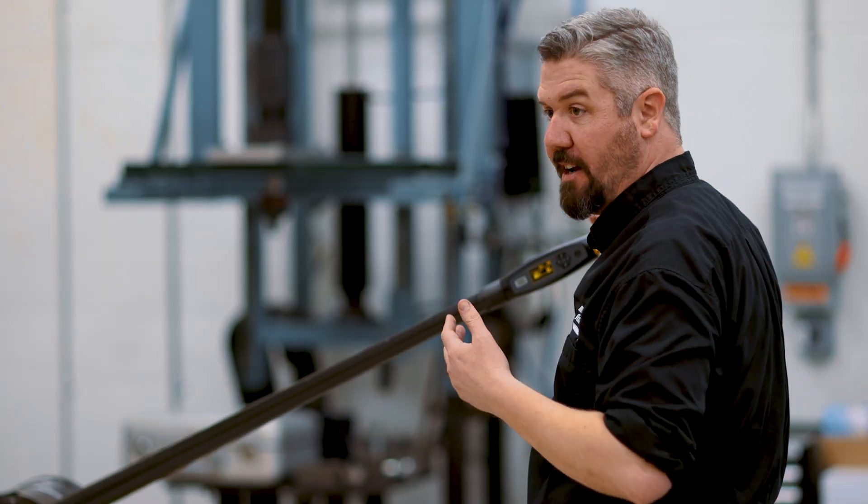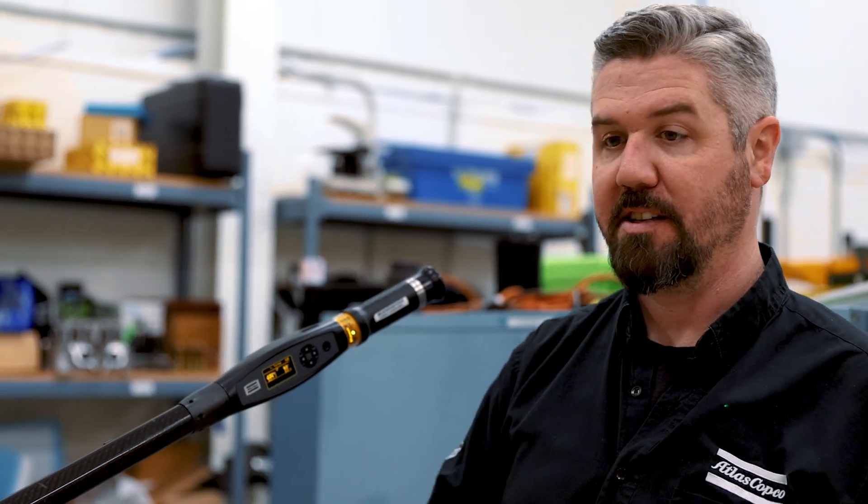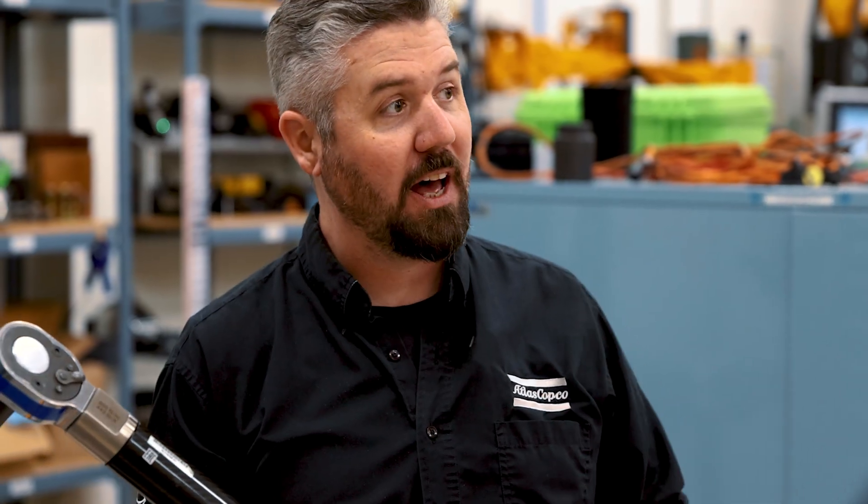There we go — 489 Newton meters with a 500 Newton meter target. We're well within the normal range of the dynamic torque, and this really builds confidence as a manufacturing engineer that our process is capable and doing what it's supposed to. So there it is — that's residual torque. At the end of the day, we get this question a whole lot about why it's so important to audit the tightening process, and really it's about making sure those bolts stay tight. We'll see you next time.